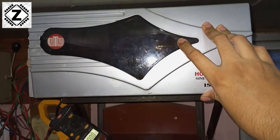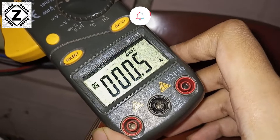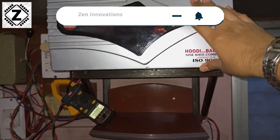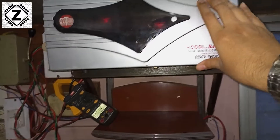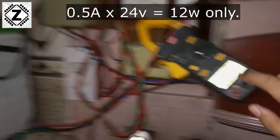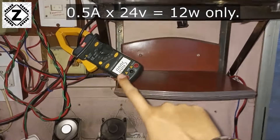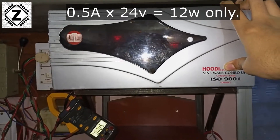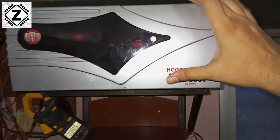Are you ready? Three, two, one — and there we go. The clamp meter has started showing a value and the value is just half an ampere. This actually surprised me at how efficient this large 24 volt inverter is, because considering this machine is a heavy duty beast with very large transformers and huge heat sinks, I'm actually impressed by the idle consumption of just half an amp. If you multiply half an amp by 24 volts, the answer we get is just 12 watts of energy being used by this inverter to keep itself alive and working. That is the idle consumption of this 24 volt model.